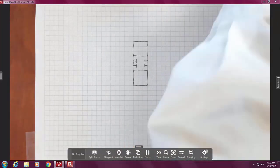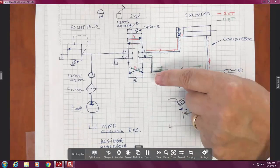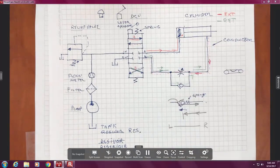Now, what's misunderstood sometimes are the arrows, and sometimes even in the e-learning you're doing or the books, they get it wrong. Because books start with an engineer or technician who knows something. They write something and draw something. Then it goes to the graphics department who don't know all the subtleties of the meaning of these symbols. And so sometimes the crisscross arrows will end up way in the corner, but then they don't match the ports we just hooked up. Pneumatic valves have five-way connections, and they get very confusing when they're not drawn in the right spot.